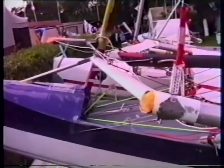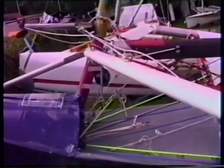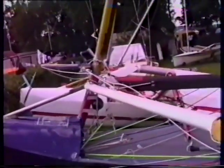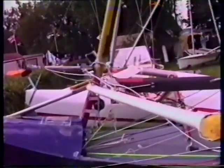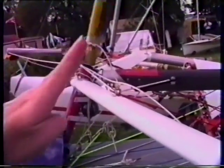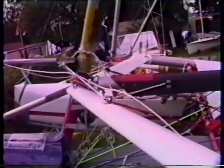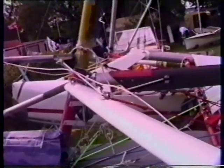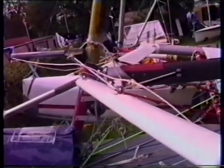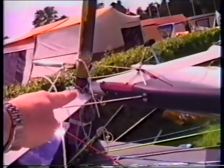A feature of the way Clive's got the system set up is that he has a mast stump which is raked aft at quite an angle. The mast sits on top of that and can be raked forward and aft. In strong breezes he rakes the mast a long way aft, like so, which requires that the boom vang must be at the correct length. Otherwise, as he eases the boom out, the vang will let go. So the boom vang pivot point on the boat, the gooseneck point, and the stay hound point up there are all in alignment.